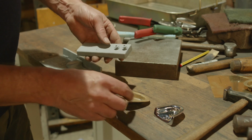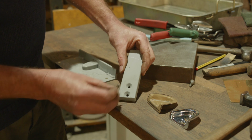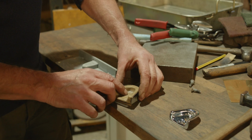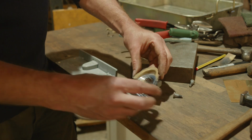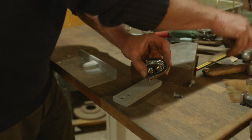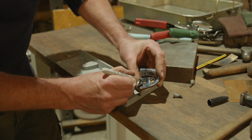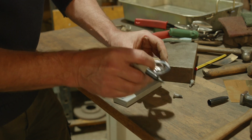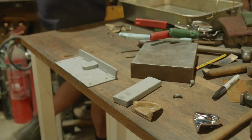And that's where this one comes in. So we've got the dimples here, and these will help form them. So effectively that's got to sit over there. We're going to make a couple of holes to allow these to go into those dimples. So let's get an idea of where they've got to go. Probably best to just start them off with a little chaser and then punch a hole, and then I can use these to set them. So something like that. Let's get a Whitney punch, punch some holes.